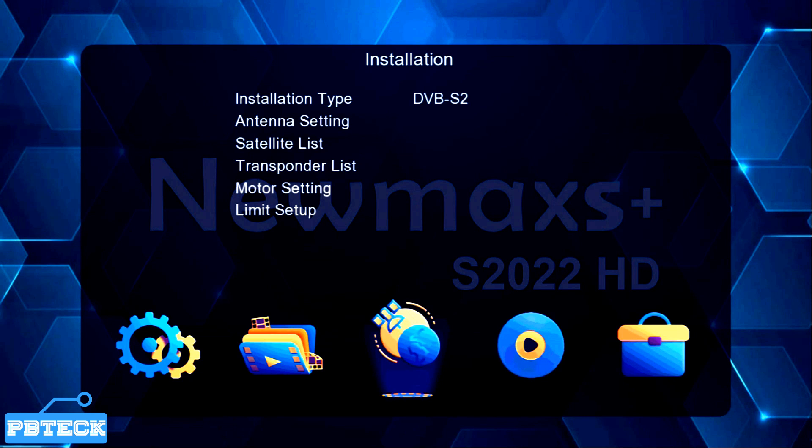The TP I'm going to highlight on your screen is 12518 Horizontal 29500, and that's the TurkSat TP. On the NigComSat satellite, you have different TV platforms: TSTV, NextSat, and other options. That TP is for TurkSat, so you add it and go straight to your satellite dish if you are not already having a signal, just to search for a stable signal from NigComSat.